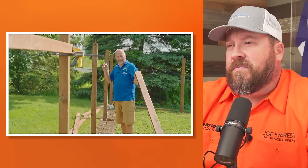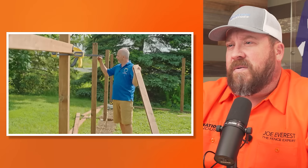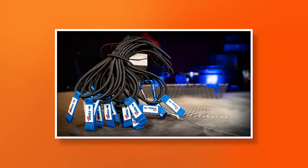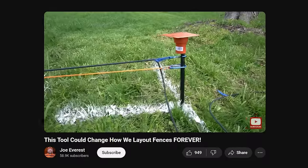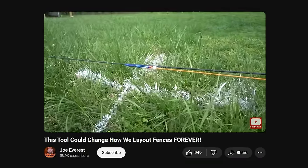Every time you don't have to drill a hole or put in a post you're saving money. Most fences you've got to have all these perfect on center, and he says it takes an insane amount of time to line it out — but it doesn't. There are tools. The Equalizer by Mr. Fence is one — I don't get paid to promote this, it's just a nice tool that instantly shows you equal sections, and you can buy them in different sizes whether you want 8-foot or 10-foot on center. It actually takes less time than re-drilling holes you didn't get right, like Jeff had to do the first time.